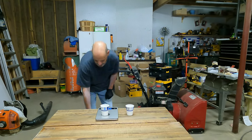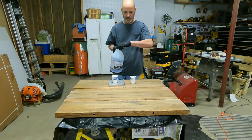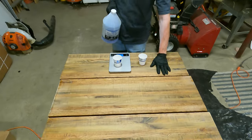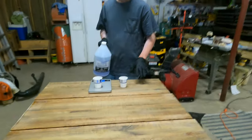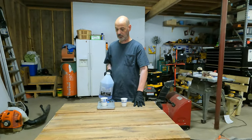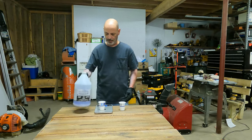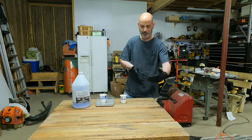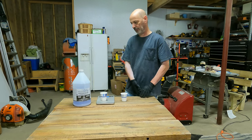We're going to work with a little epoxy today. These are Chris's shelves and he wanted them coated. I'm just sealing them because when you've got nice flat shelves, if you put epoxy on just one side and the wood's not completely dry, the water will evaporate out of the bottom and they'll bend. If this is the side that's epoxied, the ends will bend up on you. So when I do them I always seal the top, the bottom, all the sides.